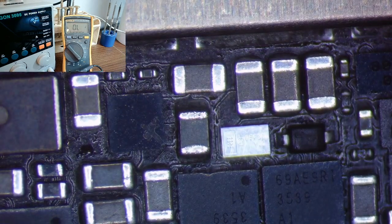All right, guys, so let's go ahead and disconnect all of the things that we do not want connected while we're applying hot air on the board. So what we're about to do is go ahead and replace that IC and see if we get any other results or different results than what we have. All right, so figure out the best way to do this. Figure out where I want to be applying my hot air. I think I'm going to have it in that direction there.